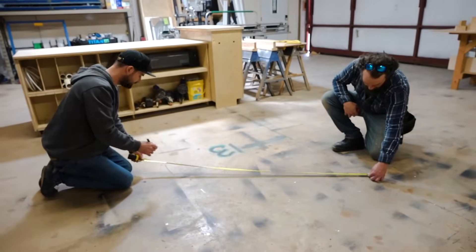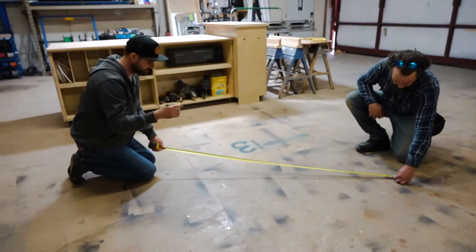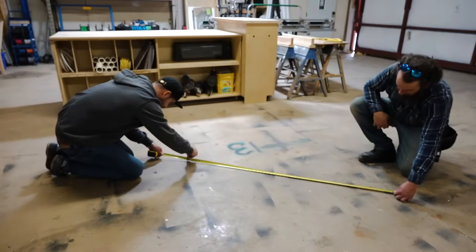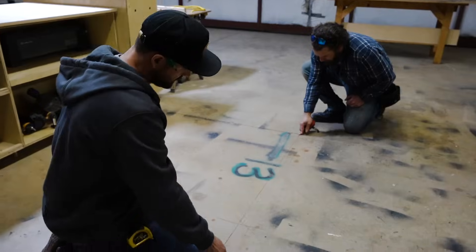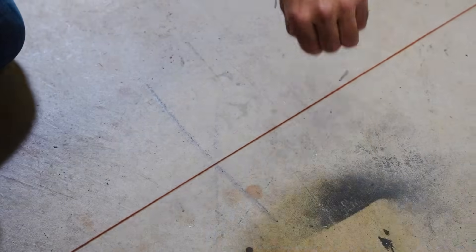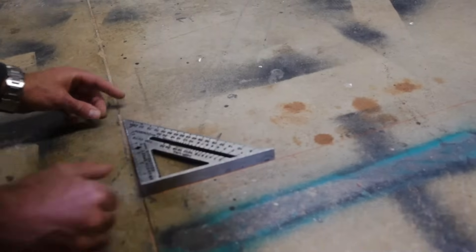Then you're going to go over to that mark and since this one needs to be five — because we've got three, four, and five — you take the pencil and put it on the five foot mark and do the same thing, drawing a simple arch like that. I exaggerated these; normally you'd make them a little more fine point, but I really wanted to make sure you could see it on camera. See where they cross? That's your center point. Justin's going to hold on our point and then I am going to pull tight, get it right in the center of that X, and then we have our line. And now if we take a framing square — even a simple speed square — and line it all up, it comes out perfect.